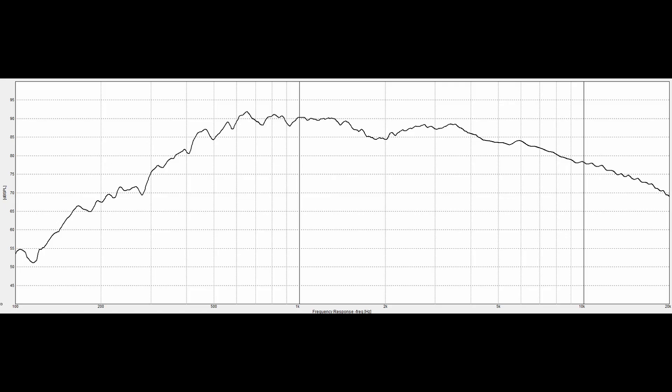But looking at this measurement, we do have some messy reflections and stuff, but just try to ignore those. The diffraction I want to concentrate on is around 1800 hertz, 2700 hertz, 3200 hertz, thereabouts. These little peaks and dips are kind of our primary concern in this video, and I want to get rid of those, hopefully, with this roundover that I'm about to apply.